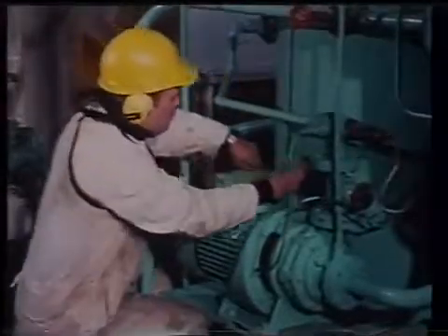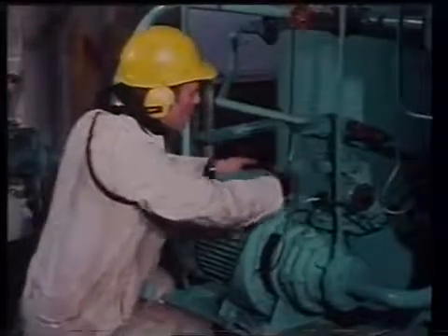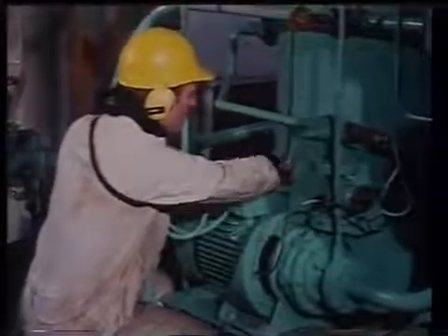Check that all motor stator windings are clean and dry. The surveyor may take one or two ventilating grids off to inspect the windings for cleanliness and dryness. This applies particularly to drip-proof, weather-proof, and deck watertight enclosures. The surveyor will want to look for the ingress of water or oil.